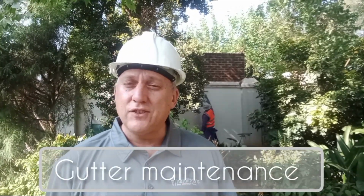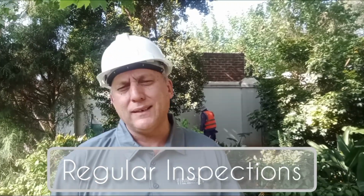Okay, while we've got Prince there at the back painting over my damp repair, there's a couple of tips for keeping damp under wraps. And that's: seal cracks, have sufficient drainage systems, gutter maintenance, make sure your gutters are clean and water flows away from the home. Regular inspections. And remember, it's simple. No damp, no damage.